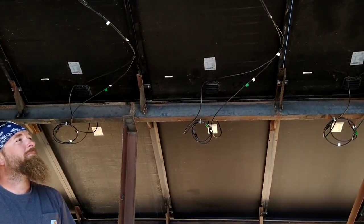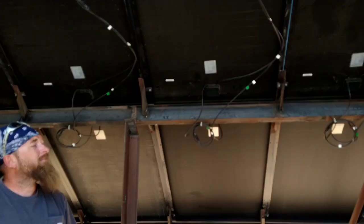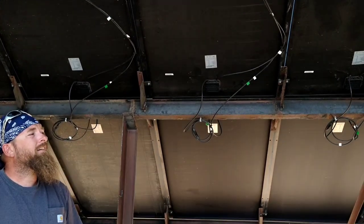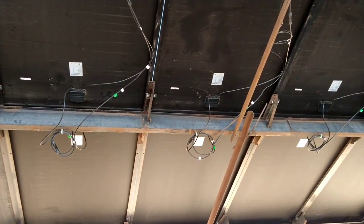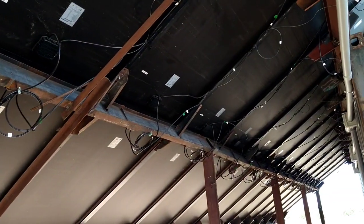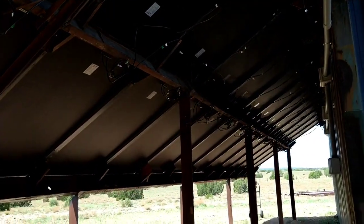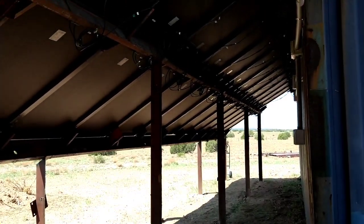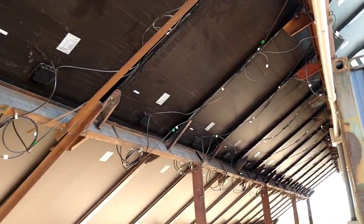This system is built from 78 OVA 255-watt panels. They're wired in series — series of three — and then 26 in parallel. That gives us 19,800 watts and 219 amps.